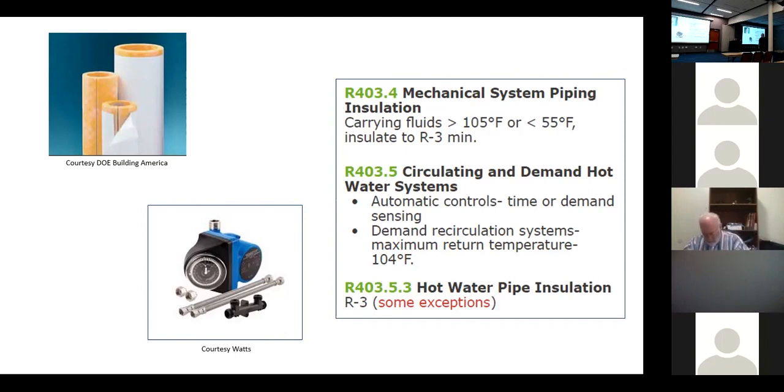Anybody ever seen a frozen air conditioner where the coil freezes over? And it just keeps growing ice until you shut it off? Well, these little air handlers have an air conditioning coil and a hot water coil all built in the same little slab. So they have 4 rows of air conditioning coil and 2 rows of hot water coil. And you freeze the air conditioning coil, and the ice grows and encapsulates that hot water coil with stagnant water in it and freezes the coil.